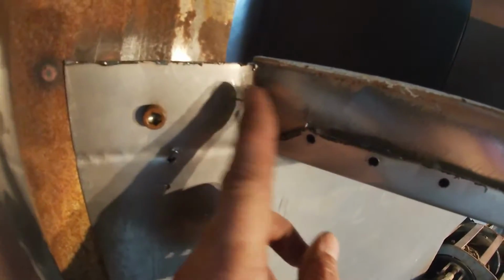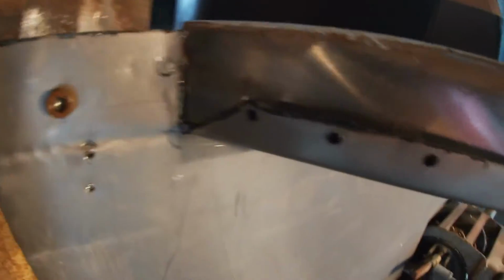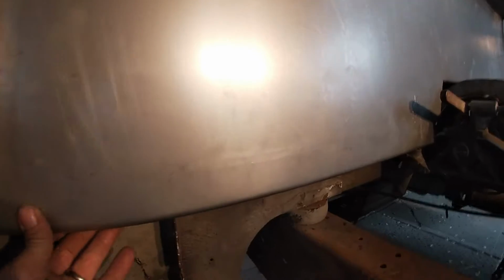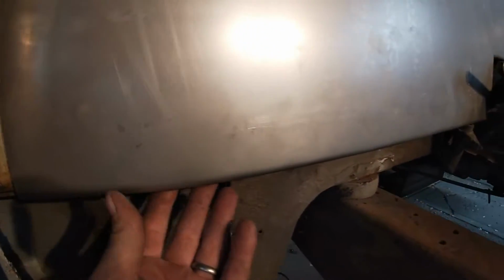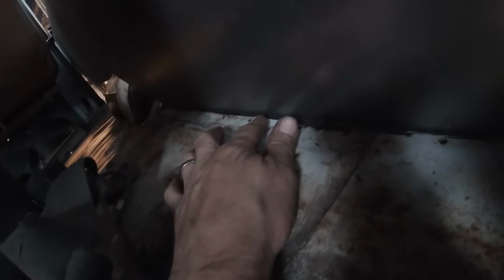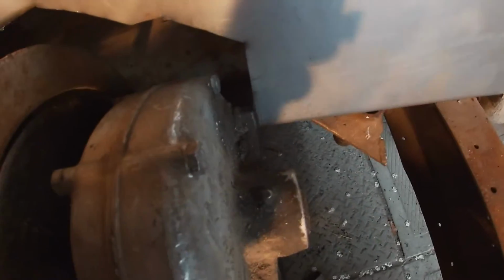Got the flap bolted up so that it covers that little area. And we'll pull this in with some heat clamps. This is still loose under here, but the edge is bent under. Inside here, you can see the plug weld holes are punched in all the way along. They're close. We'll have to push it up a little bit. There's a little bit of a curve going on right now, and once we push everything in, it should flatten out mostly.